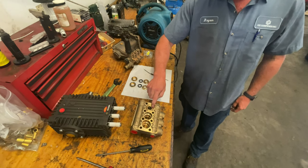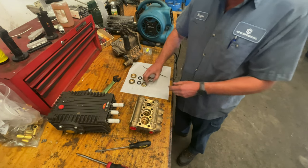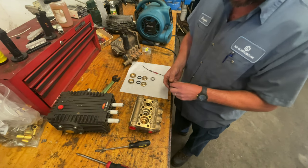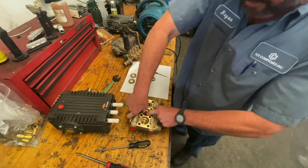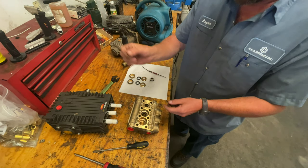That completed the packing for one of our pistons. We're just going to repeat. Packing support ring all the way down, our high pressure seal. Sometimes these can be tough to get in, especially if it hasn't been in a pump before. Our spacer.